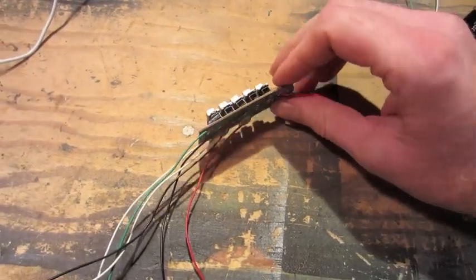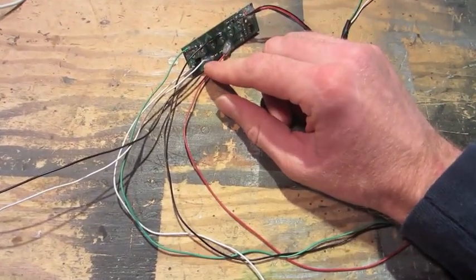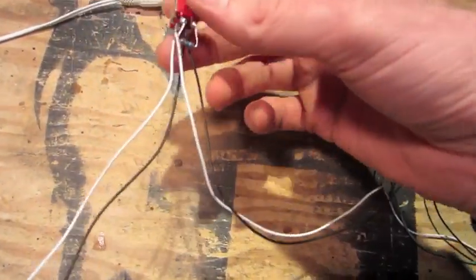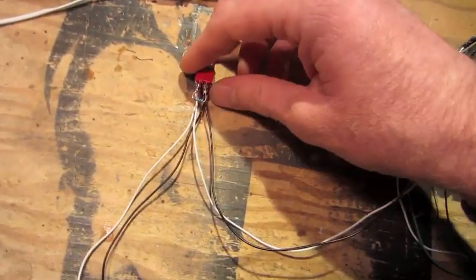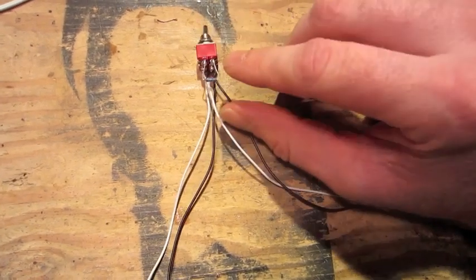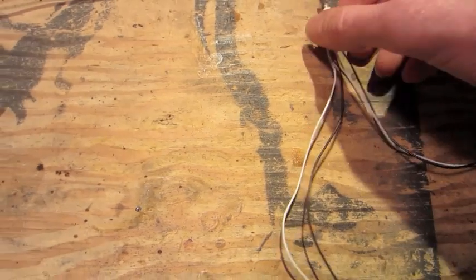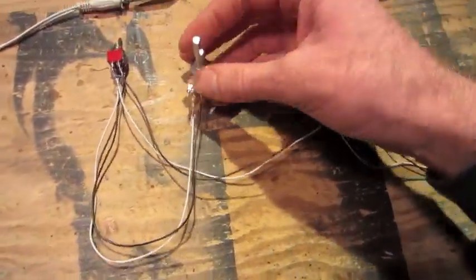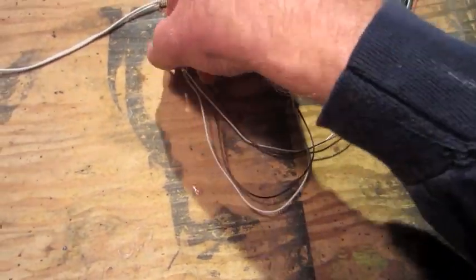Alright, so I've got the voice changer circuit. I've extended where the pitch resistor was out to a toggle. I wasn't able to reuse the small surface mount resistor, but I replaced it with the same, this is the 15K resistor here. Wired it to a toggle switch and to a 100K pot, so I can turn it on and off.